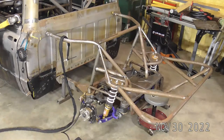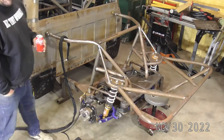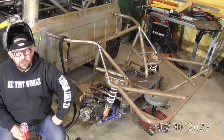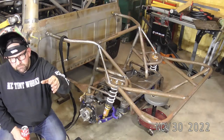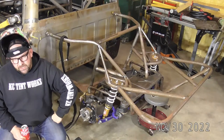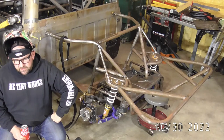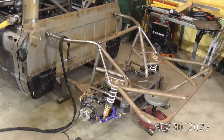Fly High 8060, what do you think about the Storm 215? That's a running little son of a gun. There's one of our guys, Brad White, he's actually using that for a subcontract job right now where he's cutting up the loading point for big roll-off dumpsters. He's cutting that off with the plasma on the Storm 215 and then welding 3/8 plate back into it. So for a little machine, it's got quite a bit of power. And those have been a really solid, stable machine for us too.